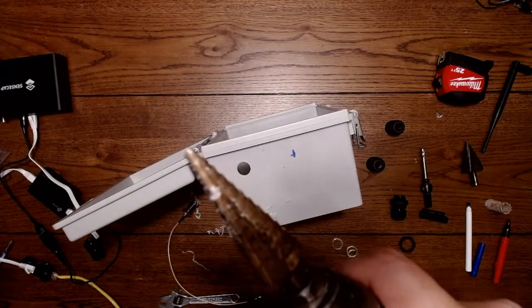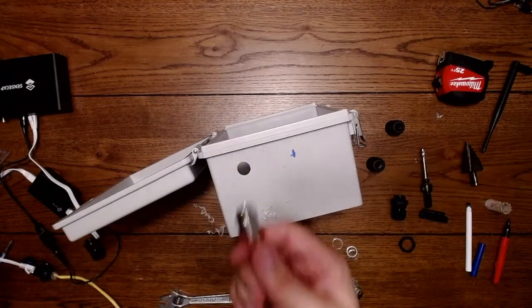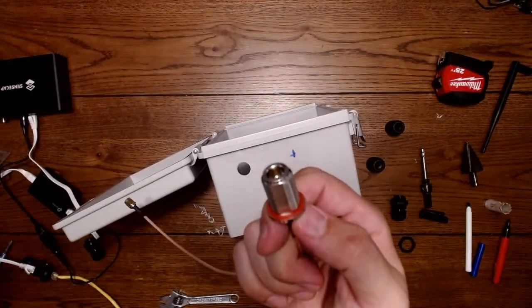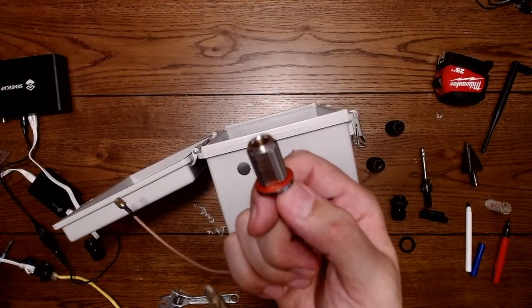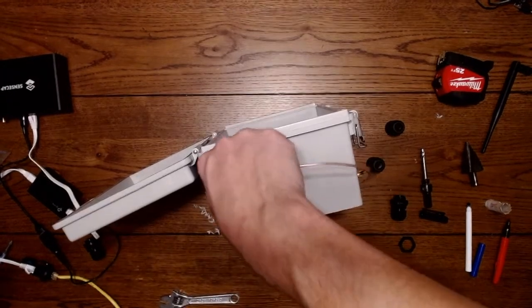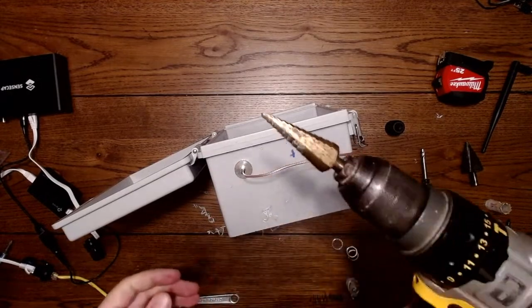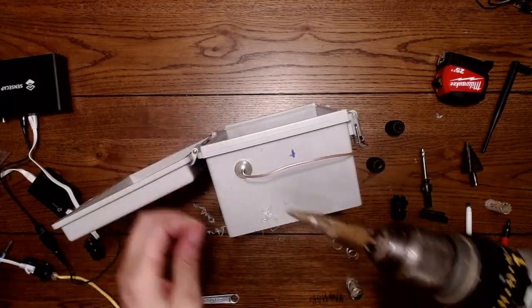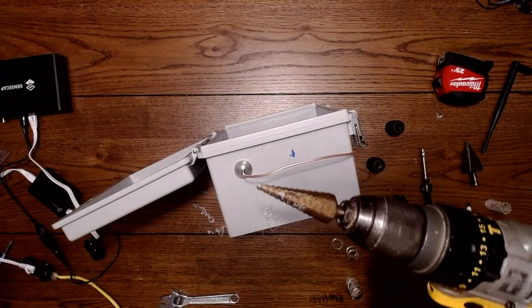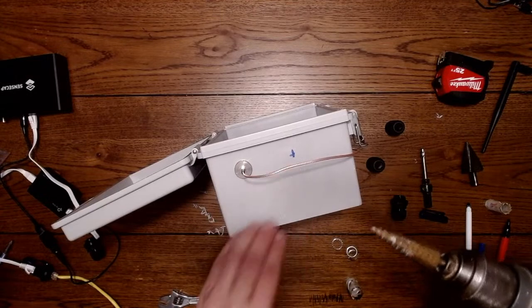Alright, so the size of that was 5/8. So if you have this bulkhead, I'll post the links to some of the fittings in the description below later. This is 5/8 diameter. So that fit in there pretty perfect. I mean, that's as snug as you can get. But you see how I went really slow and tested the different sizes, because if you overshoot the size, you can't go back. You get one shot at this. So just make sure you do it right.